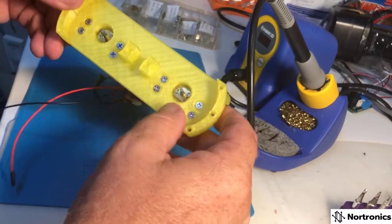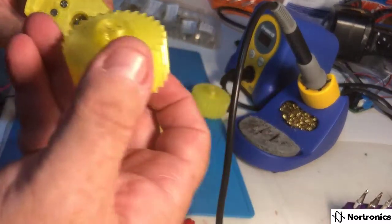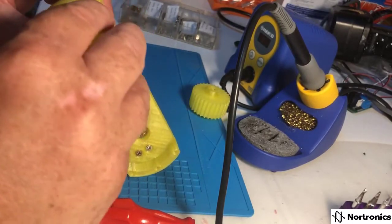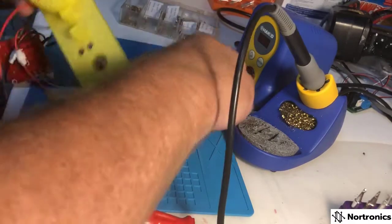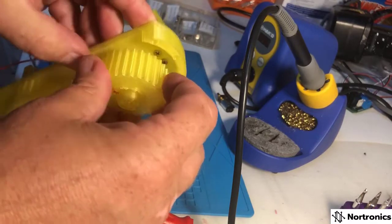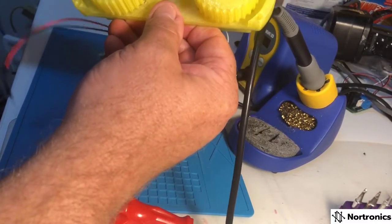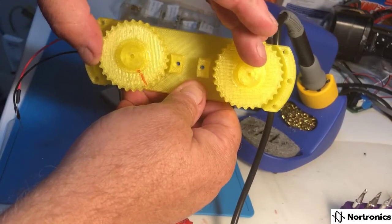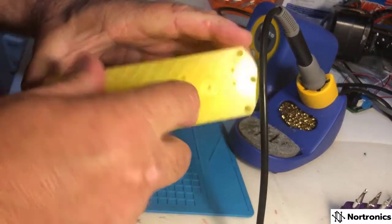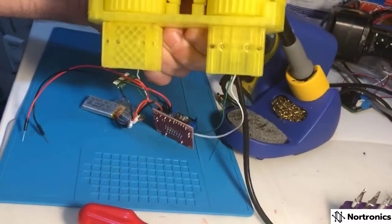After all the assembly, we've got the motors neatly bolted in and secure. All I have to do is put on the gears with the index in the right spot — and the other one. Those gears will be clamped down on the front so they can't slide. A bracket clamps on there holding everything in place so the gears can't slip. That is my motor assembly.